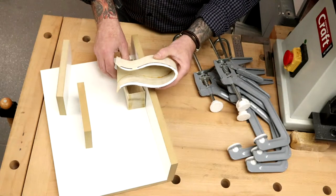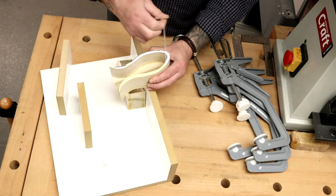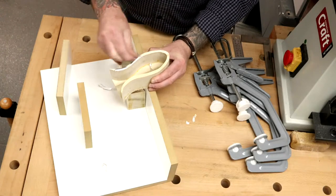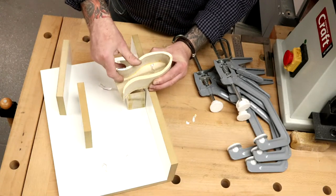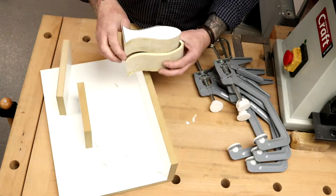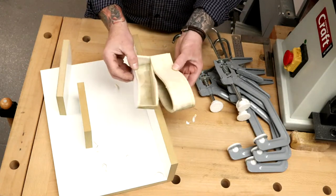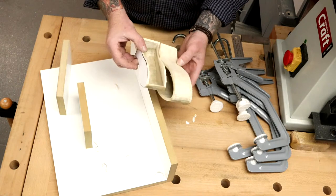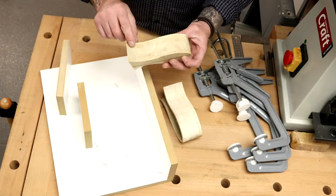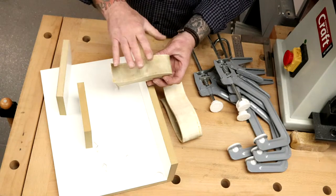All right, you see that? You can see I've got the remnants of a bit of paper that I put on there. That comes off easily. The Copydex glue is almost like a rubber type stuff, and it doesn't adhere incredibly well to the wood, which is what we want. All right, and there we go. You can see that it's exactly the one we've just cut, isn't it? We've got very subtle sanding to do to get rid of the glue and the minor misalignment in that piece, but it is minor.